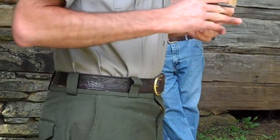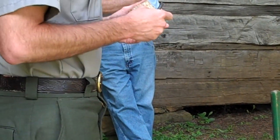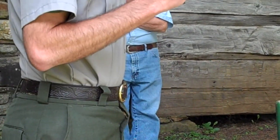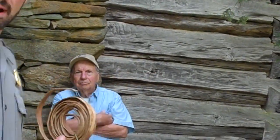This here is a piece of white oak. White oak — where they would find white oak is either in the bottoms, in the flood plains, or on the northern slopes away from the laurel. If they found them on the ridge lines, that wind would batter that tree and twist that tree. Nearly impossible to get splints such as these out of a twisted tree.